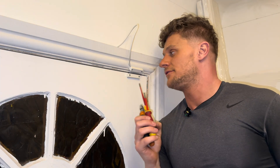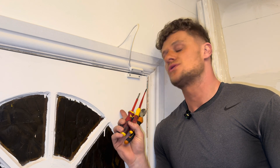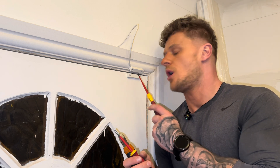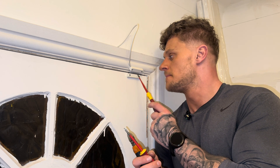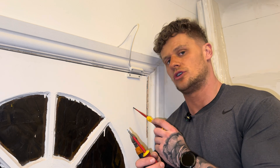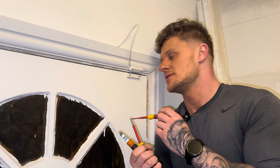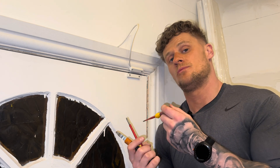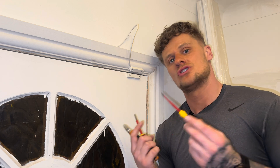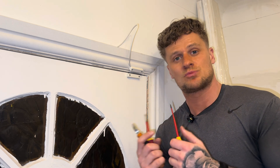And there we have it — you've now wired and fitted a front door contact onto the door and into the panel. A very useful tip if you have a new door: I would advise not drilling the door. Use super glue to attach the contact and the magnet instead of drilling. It won't cause any damage or affect how the door works. But if your door fails and you call the company who fitted it to return or replace it, they could say you've drilled the door and voided your warranty. So to protect yourself, if it's a brand new door, use super glue rather than screws.